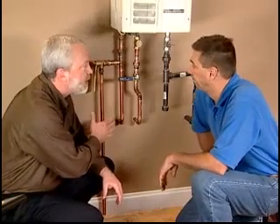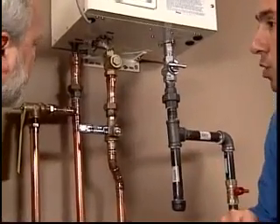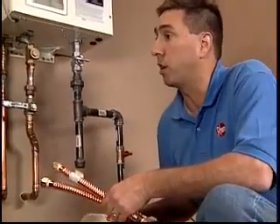We're ready to move on to the hot water heater. That's really nice, Jim, and I see you've got the hot water side done. Is there anything unusual about that part? Not really — it's pretty simple and straightforward. But I would like to point out a couple things. You'll see we installed another union in our connection. We've also sweated our joints and checked them for leaks. Most importantly, we've installed a pressure relief valve here on the line — that's a safety valve required by code. And I notice you've used traditional copper here. Can you use the flexible type? Sure. For purposes of this demonstration we wanted to use hard pipe connections, but you certainly can use flexible water lines and a flexible gas line, just as long as they're the right size for the water heater.